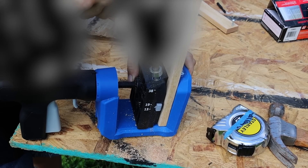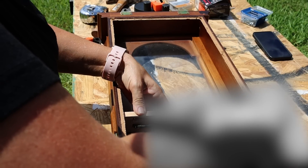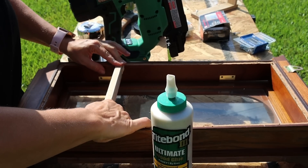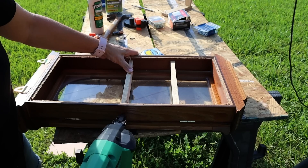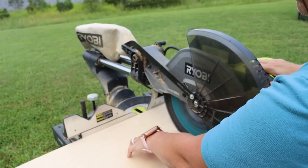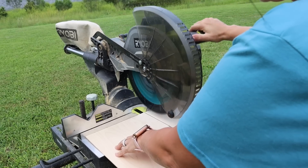I had actually purchased an oak piece of wood to use as shelves, but I didn't even need to fork over the money for the oak because it wasn't even oak to begin with. My initial plan was to actually do some pocket holes and attach that to our cabinet, but it was a little too tight of quarters for that to work. It didn't matter because we are going to turn it into a spice cabinet. I just cut down three shelves and ended up adding plenty of wood glue and nailing them from the outsides to hold them into place. Then we cut out a new backer piece for the back while making all our other cuts. I went ahead and did some putty on those nail holes on the side.